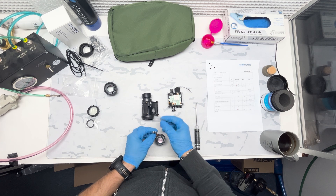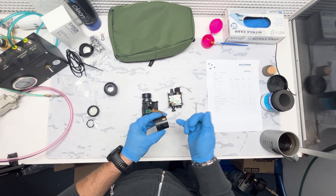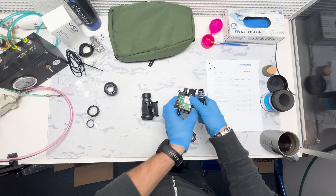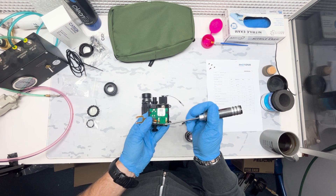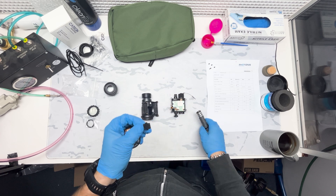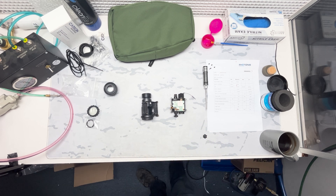One of the things protected on here is the prongs for the manual gain pigtail. The pigtail is going to get plugged into the board in four different points and is protected with a little plastic protector. There are two power pads that are going to be connected onto the PCB board - those create the main source of power for the tube as well as the pigtail. You can notice that the connection points are at different spacings from each other so you cannot orient the pigtail wrong when plugging it in. When you remove the protector over the pigtails, make sure you don't bend them accidentally - they're very easy to move. I'm just going to check to make sure they did not get bent, and they did not.